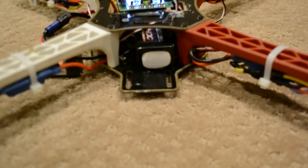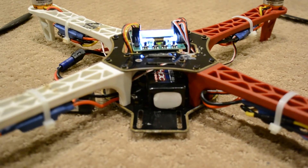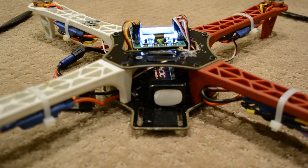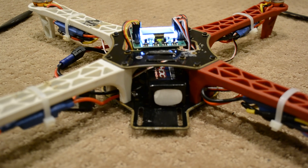I don't know what's happening. All I know is that all the motors are alright, because the motors that are misbehaving, when I switch their pins, they start behaving correctly, but the other one stops working correctly. And the ESC calibration isn't working. My best bet is that the KK2 may be defective, but this is the fourth board I've tried and they all seem to work badly at some point. I have a graveyard of KK2.1.5s. I'm probably just going to change suppliers, since obviously the quality control for these isn't very advanced. Please help me, because this has been an issue for the past six months. Any help would be very appreciated.